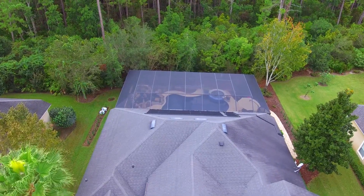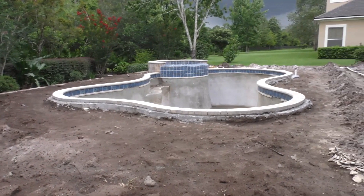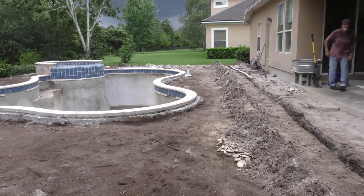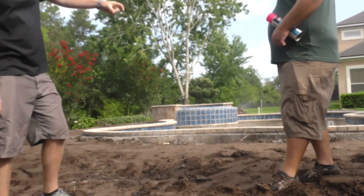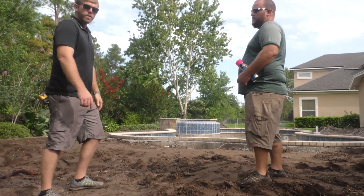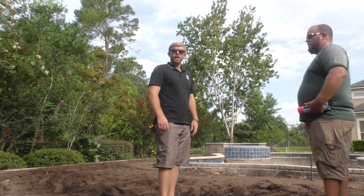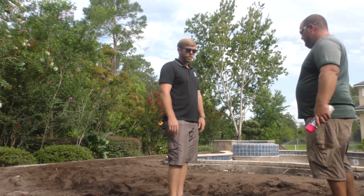What's interesting about this one is we get to put this in a screen enclosure. If you pan around, you can see the concrete wall going around everywhere — that is the footer for the screen enclosure, and behind us is the pool. With pools, you always have to come in at the right timing. We always come in right after the coping is done — that's the concrete paver poured on the outside of the pool. Once that's done, we know our top elevation, and from that point we can shoot grades to know where our water level is going to be and start setting the pond. I'll let Sean give you a briefing on what's up with the pond.